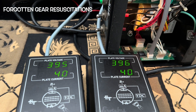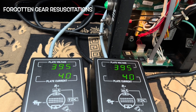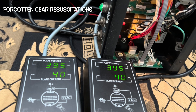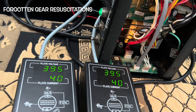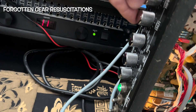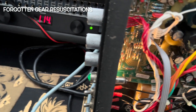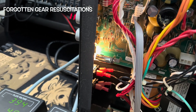Let's get the volume up. You can hear that noise. Very — wow — there's a non-existent background hum. Just a little bit of hiss from the treble pot over in the clean channel. Let's change channels, get the level up. Oh, you do have a master presence pot — that's nice. Let's get our gain up about midway, treble, mid, everything on mid. Very nice. Your pots are nice and clean — they don't require me to clean and lube them. Good day for the white silicon grease of the world.